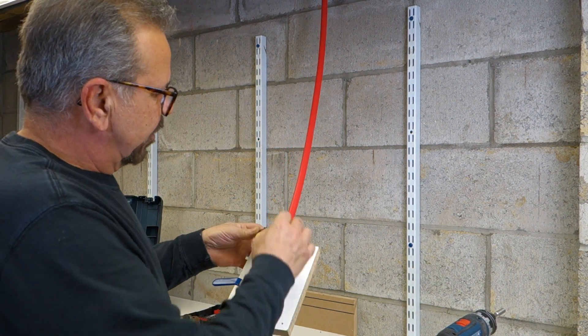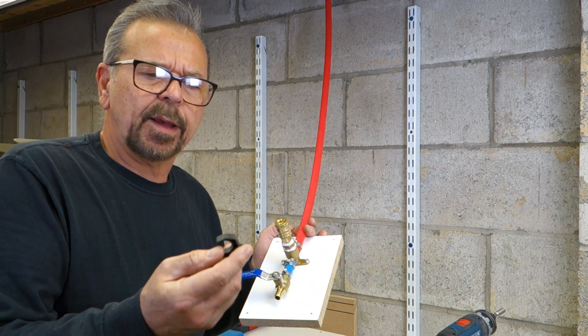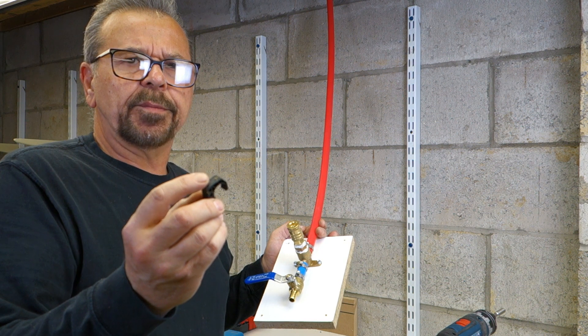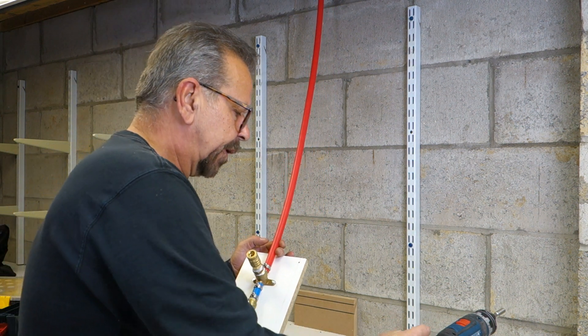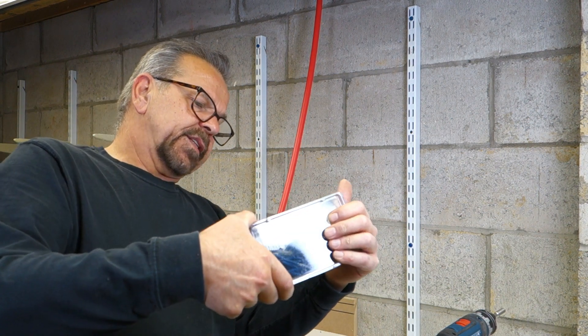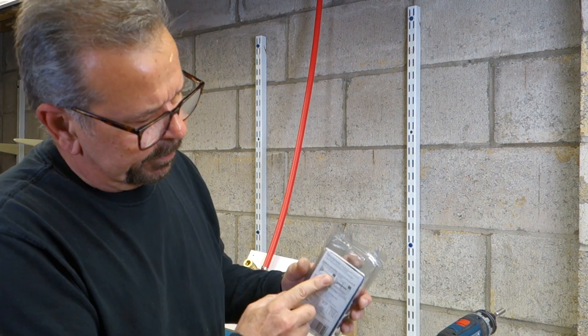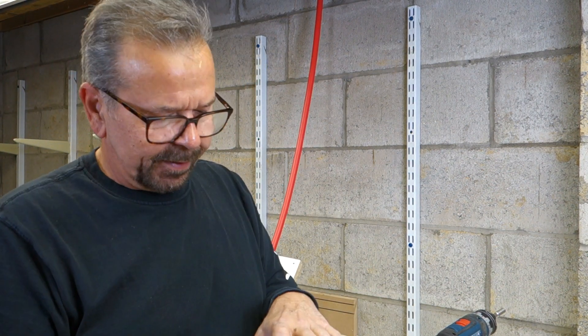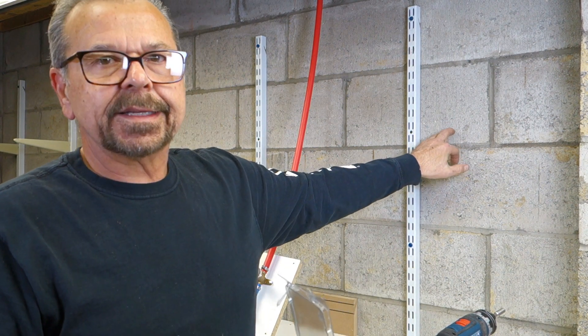You can also get these fittings here — actually, they're cable clamps, so to speak. We just drilled this one out so we can put a Tapcon anchor screw in. Just a quick note on Tapcon: it's actually pretty good regardless of what people say — I've had no problems with it. This here is concrete block, not cinder block. So we're going to attempt a 3/16-inch, but we may have to go to a quarter inch. They do tend to break off more easily in concrete block rather than cinder block. Let's give that a quick shot.